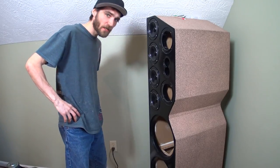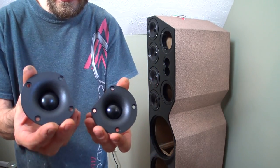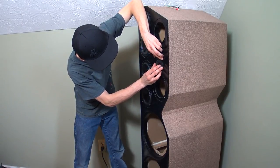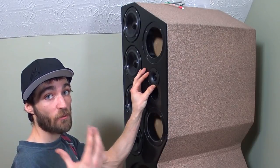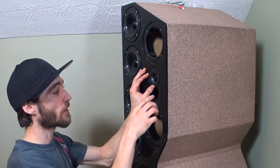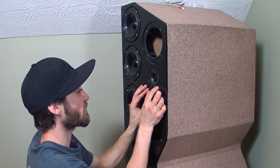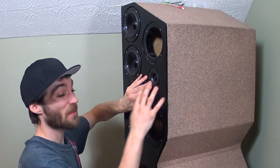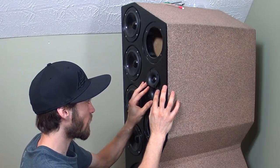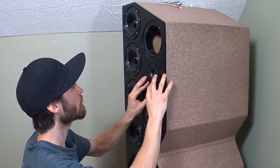In this video I think we're going to do the tweeters next — here they are. We went ahead and sanded them down on the YouTube video; I hope you guys watch that on the main channel just to get them really close together. The previous tweeters had three screws; these have four, just like our mids. So we're going to have to position it somewhere like this. I want to center the edges of the tweeter in the center of the countersink to make it look like there's a perfect circle around the border. So I'll put the center of the sand mark right in the center of this little groove. I'll make sure I have the bottom one in there first so the seams match up too — I'd hate to have the top one perfectly positioned and then the bottom one not be.